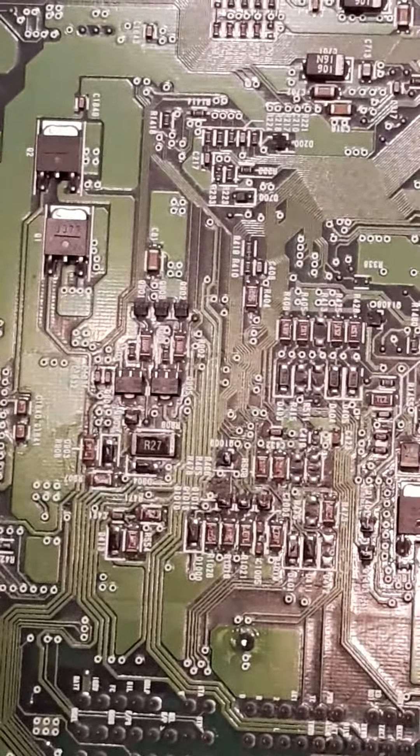I have a 2002 RAV4, and I wanted to point out those resistor values again — hope you can see it a little bit better this time. That's R330 there and that one there is R330, then dropping down below there's 820 and 820, and then further down below there's a pair of R330s here, here, and here. Then shifting over to the left hand side of the circuit board there's an R27 resistor.